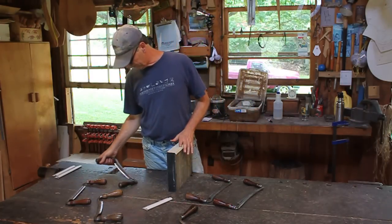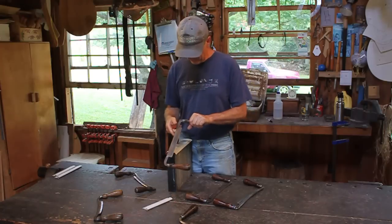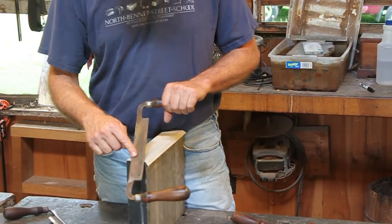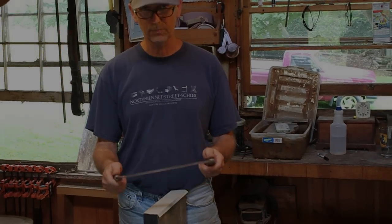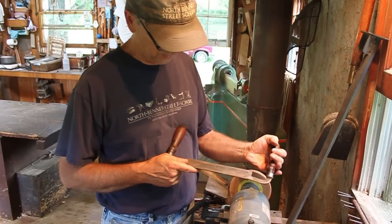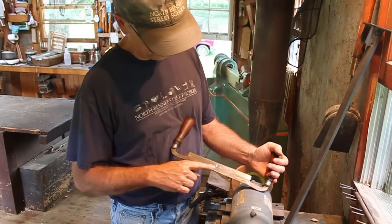When you get it home, then what do you do with it? That's what I'm going to show you. I've got a knife here that needs redoing — this one right here. The back of it — I don't know how well you can see it — but there's a little bit of rust and a little bit of pitting back in here that I'm going to have to get rid of. Generally the handles are in good shape, and the knife is certainly trying. So the first thing I'm going to have to do is get the back flat and shiny, just like you would on a chisel — only you've got a much bigger surface. We've got a little bit of rust and a little bit of pitting. Hopefully it's not going to be too bad.